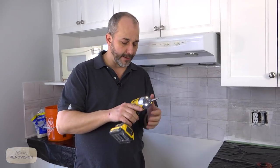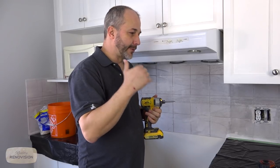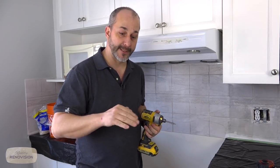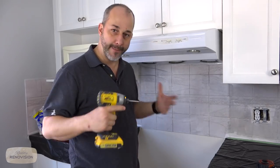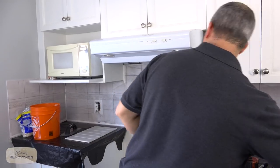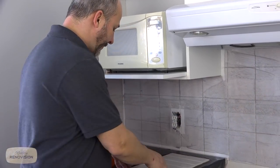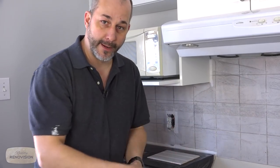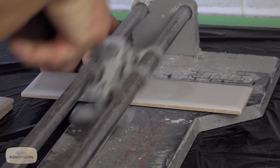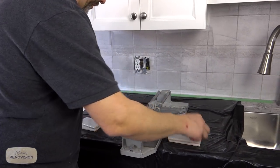There's a cleaning trick for aluminum marks on quartz — just take Clorox bleach and a little un-sanded grout and you can rub those marks out. But why make a mess you have to clean up? Since we're starting in an inside corner and we have six rows of tile, which we've already predetermined, we have to take three of them and cut them in half because we're doing a half-offset subway tile pattern. Put every tile on that same spot. In case you're just off by a hair, keep your left and right sides separate. Just a little scratch and a little pressure and off to the races — no need for a thousand-dollar machine.